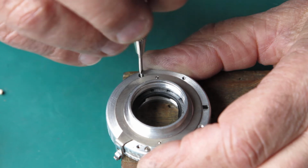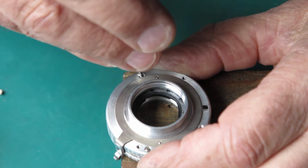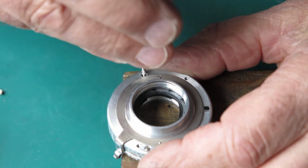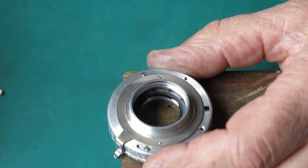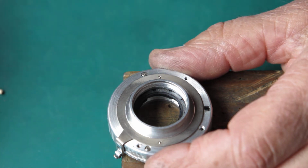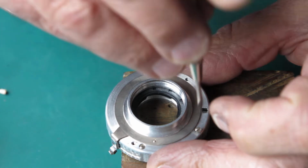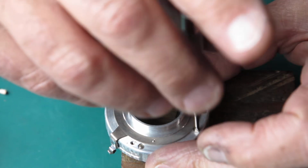If a blade gets displaced while you're putting the case over the top, it could end up trapped between one of the pivot pins and the case, and so end up getting damaged. So it's important to take your time and check that everything's correctly placed, that nothing is jammed where it shouldn't be before you do the screws up tight.